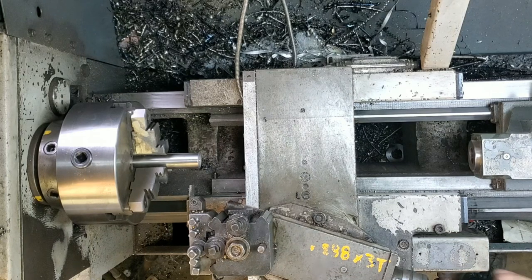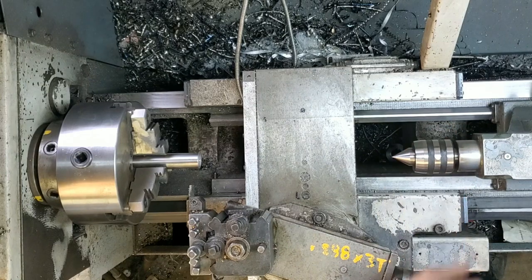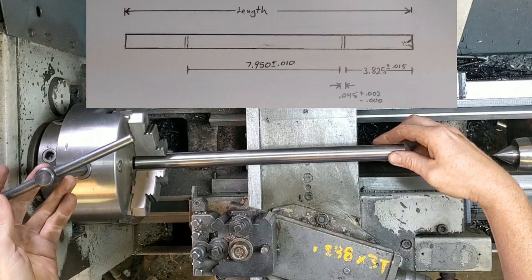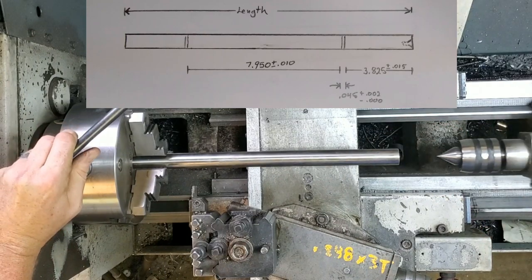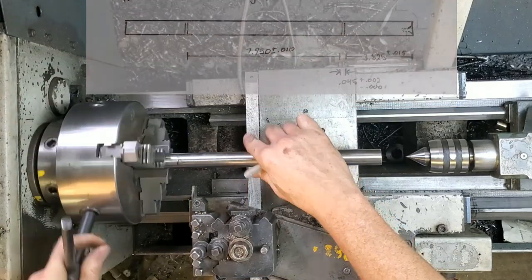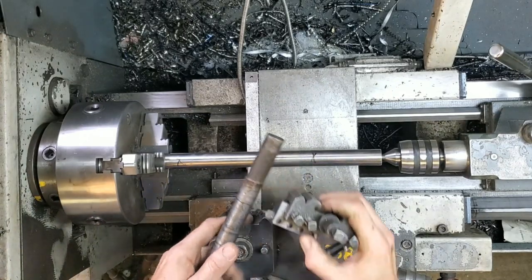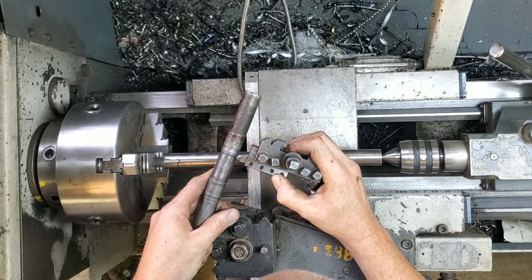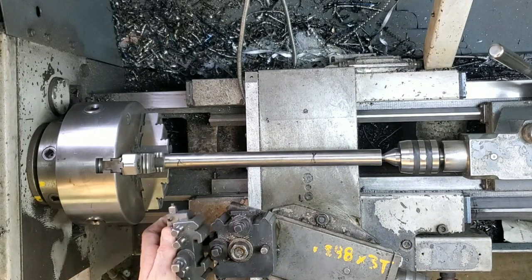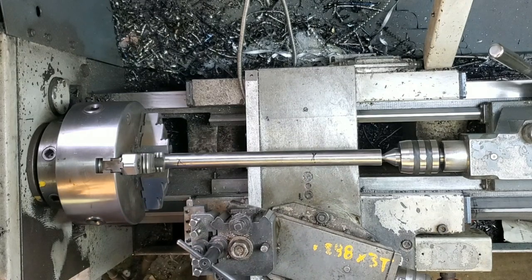Let's take a look at this measurement — this will give me the measurements between the two snap rings. If I use a digital readout, all the parts will be bang on every time. I'm going to grab this snap ring tool here and make sure I've got the right one — I have two or three different types. This is the 0.045 snap ring tool. Make sure she's snug in here.